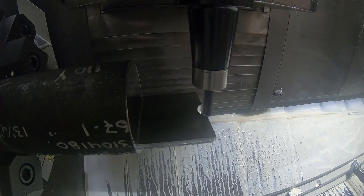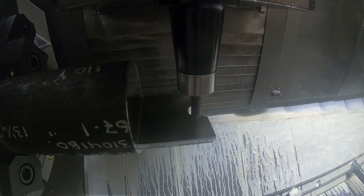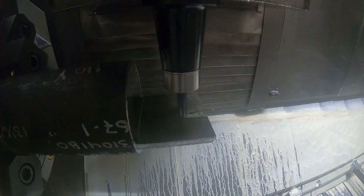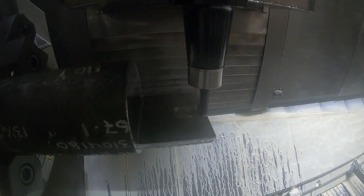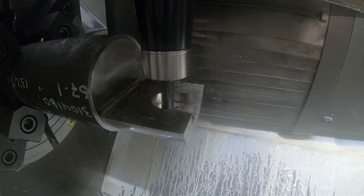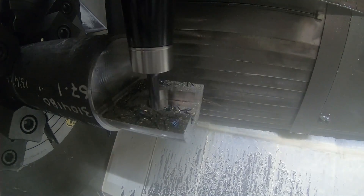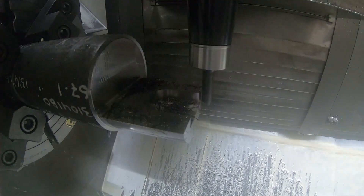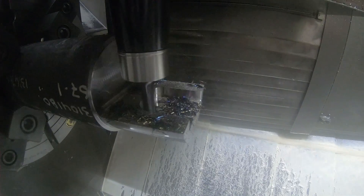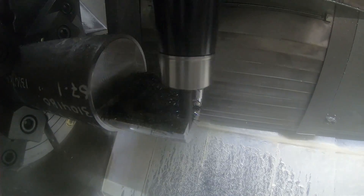Here's a half-inch four-flute carbide end mill running an adaptive roughing cycle. The Esprit software calls it profit milling, but it's basically the same thing as Autodesk's adaptive cycle - essentially a trochoidal milling cycle. It knocks out the middle with a trochoidal pass and then makes passes around it. I don't really recall the exact speeds, but I'd guess the end mill is probably going 5,000 RPM at maybe 30 or 40 inches a minute feed rate. This is sped up quite a bit - otherwise we'd be here 15-20 minutes while it mills out.